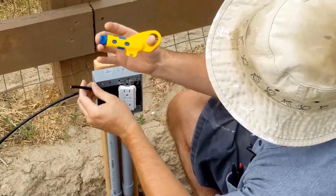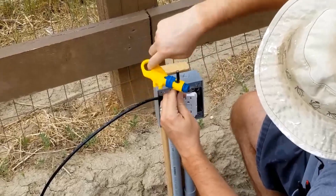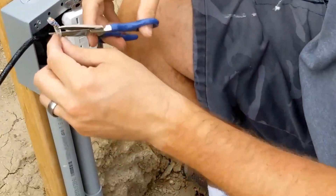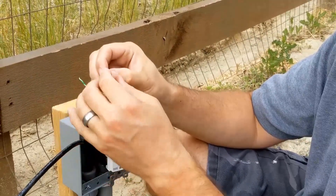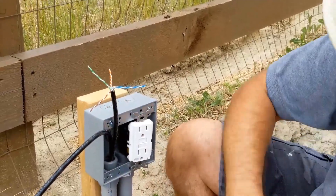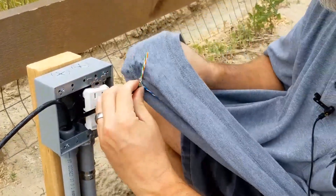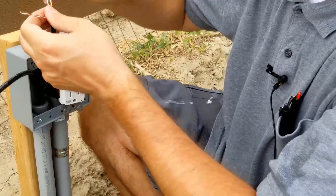The first thing I'm going to do is take these big scissors and cut the cable to length. Then take the stripping tool, go down a bit, give it a couple of spins to cut the outer jacket, and get that exposed. Then cut the filler loose. We're all gooey from the gel — I should have brought a paper towel.